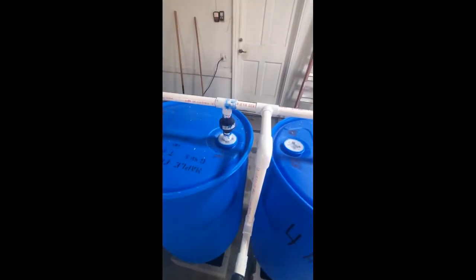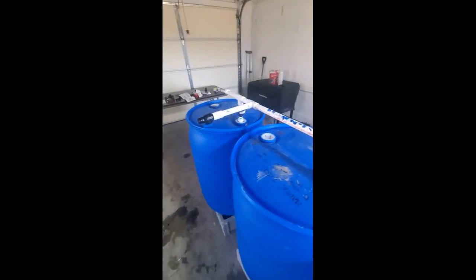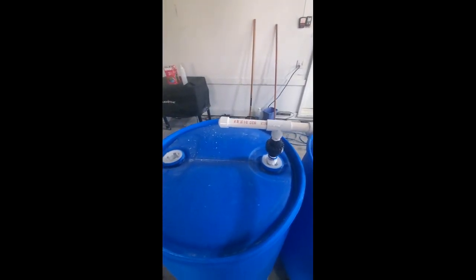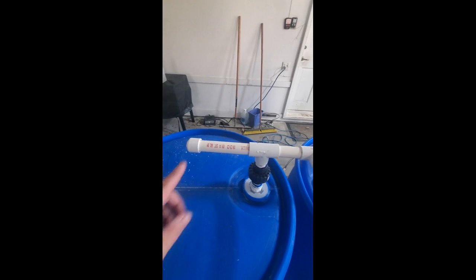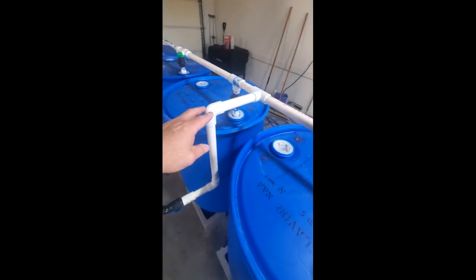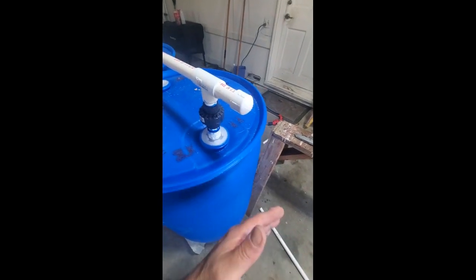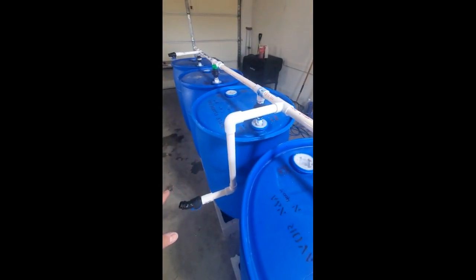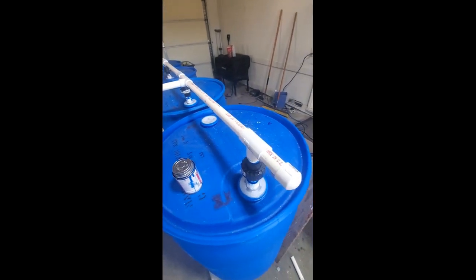Okay, so I'm going to glue this system together and let it dry, and then we'll be able to go outside and hook up our downspout. Now, if you noticed on this end, I did a little tee off here. If I want to add more barrels, that enables me to cut this and just continue adding barrels. So if I want to add to my system, this enables me to do that. And same thing on this side, because I have a side spout, you could actually take this tee out and come out the side, but I just thought that was such a great place for me to knock it with my knee and break pipe that I wanted to hide my hand watering can faucet in a place that was not so dangerous for me to knock it off at some point in the future.